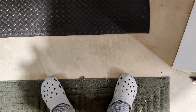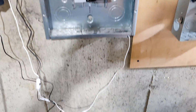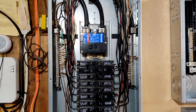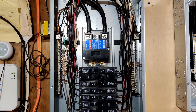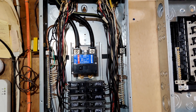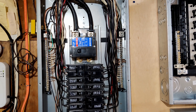Second safety note: probably don't wear crocs when you're working on this — they're not electrically rated. I am standing on a rubber pad just because I'm paranoid, though that's probably not going to save me either. One thing you have to worry about is touching two things at once, because the panel's metal case is grounded and linked to the neutral buses. So if you touch something hot while touching any part of the case, you become the conductor to neutral and ground and you will get zapped. If you can use one hand while keeping your other hand at your side, at least if you get zapped it'll only go through your arm and one foot rather than going across your heart.